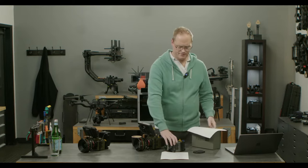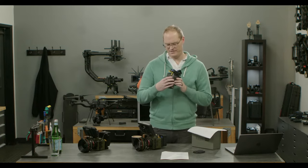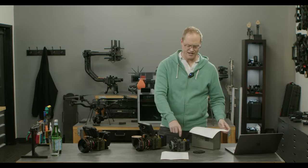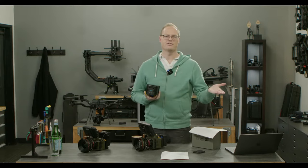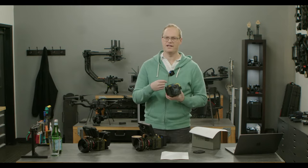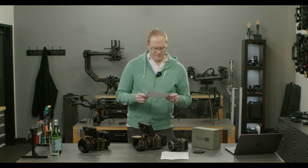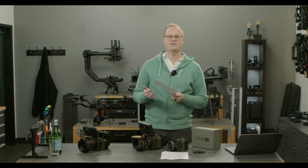What's the Ethernet port for? That'll be to connect to gimbals, cameras, live setups — just future expansion really. What's the PCIe port for? That's the expansion port off the back — an ultra high-speed port for accessories. We kicked around the idea of having a GPU backpack for real-time AI applications, or external media to write to. How long will it record with four terabyte internal storage? About 46 minutes. What type of ProRes? ProRes 422 LT, normal, and HQ are the three we're licensed for right now.